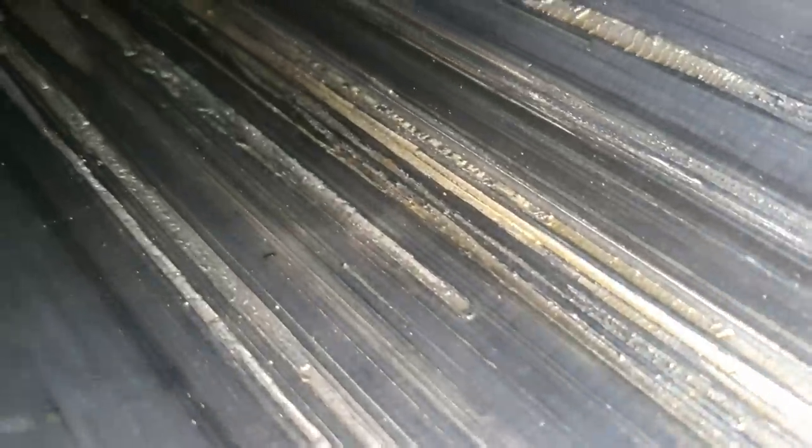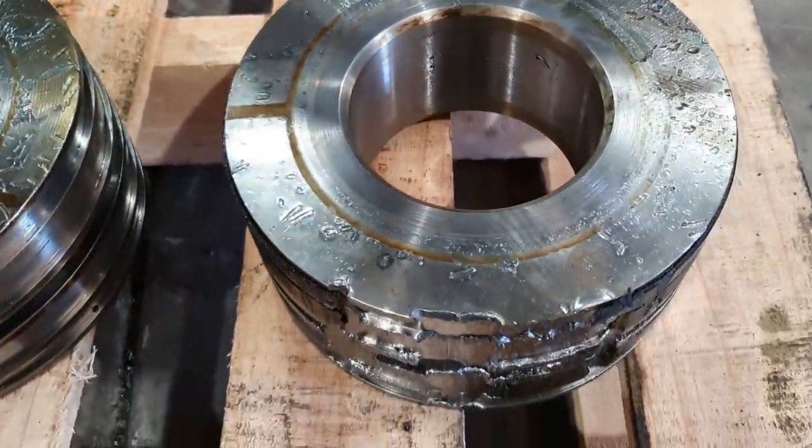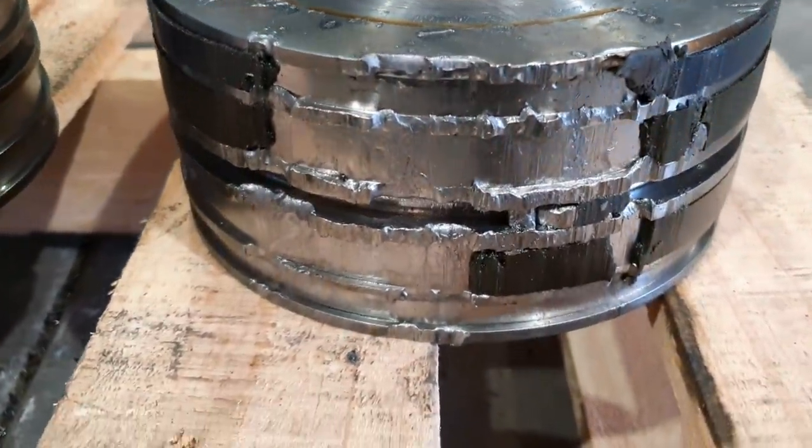get it back to a suitable stage. As you can see by the damage in the barrels, we are going to have to rebarrel the two lift rams. Of course, there is a material shortage at the moment on honed cylinder tube in that particular size. We're waiting on material for our barrels, so we'll get onto them when it gets here. And the pistons are pretty well dead. There's no fixing these at all. So for today, we're going to start doing the pistons.